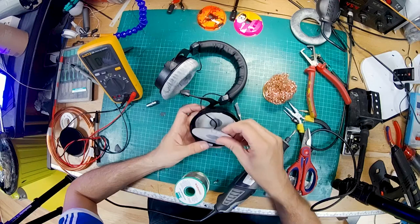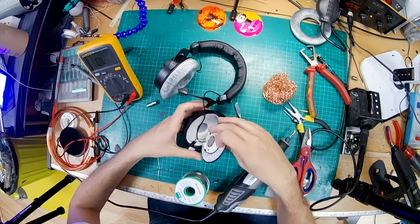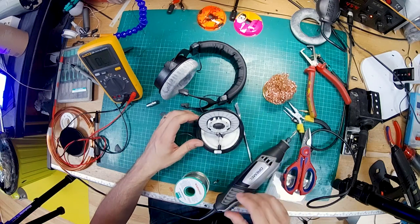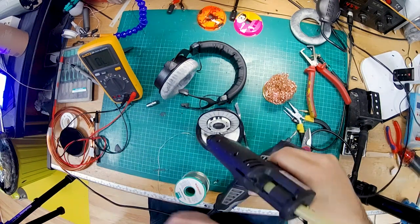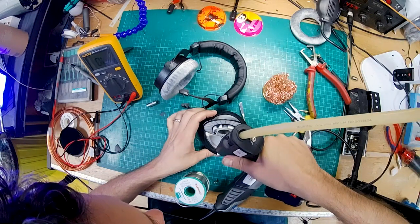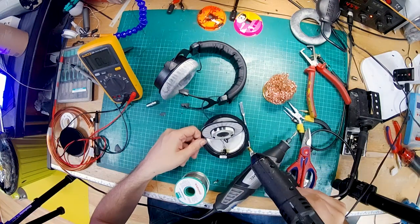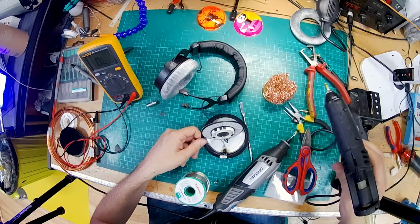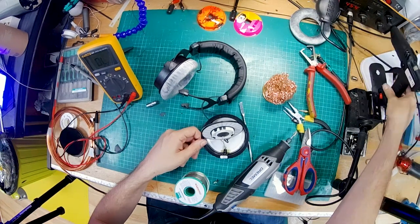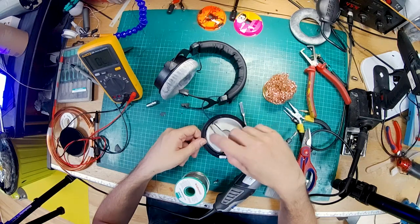I'm just going to make sure everything fits back together nicely. It does — that's all firmly in place, so we're good to go. This is very straightforward. Now I'm going to apply a bit of glue on the inside, around the socket, to stop it from coming unscrewed and give it a bit more support. I'm also going to add a bit of glue over the contacts we've just soldered, just to give those some additional support — probably unnecessary, but it can't hurt with vibrations. You don't want the wire breaking off. So that's just going to give those a bit of support. Just going to let that cool for a moment, then we can put this back together.